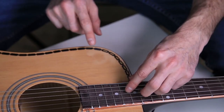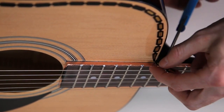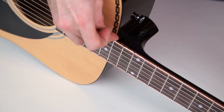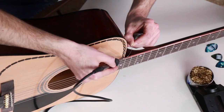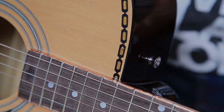When you have completed your design, measure the end of the diamond conductive tape and cut it in the center of the closest segment. Place the cut end of the diamond conductive tape against the copper point at the end of the flat conductive tape and solder them together. Make sure that you make a good clean joint. You can now put away your soldering iron.